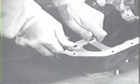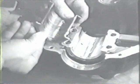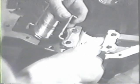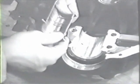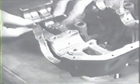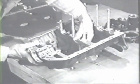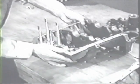Lift out each bearing half from its seat so you can inspect both the bearing and its seat thoroughly. The seat into which the bearing fits sometimes gets cracked or worn, and the bearing itself is subject to scoring and scratching. However, these appear to be okay. There are three main bearings for the crankshaft, and three more for the camshaft. Each of these should be given a careful examination. The other half of the crankcase should be inspected in the same way.